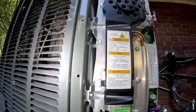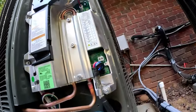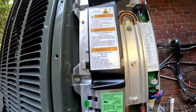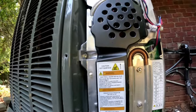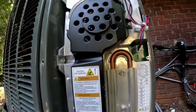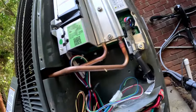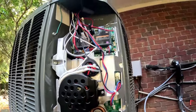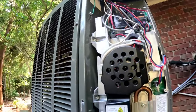I'm going to figure out where the new test points are, so I have to open the book. Somewhere in here, like the old one, there used to be two test points. The previous technician said he was only getting 28 volts DC. This thing puts out right at 400 volts DC, and when you do the discharge it tells you not to do anything until it's below 42 volts. So if he had 28, it's not putting out anything, and if it's not putting out DC voltage this unit will not run at all.